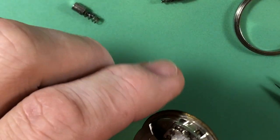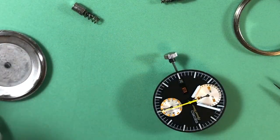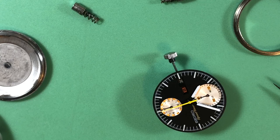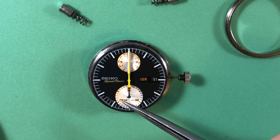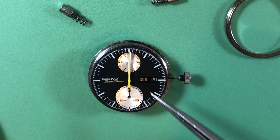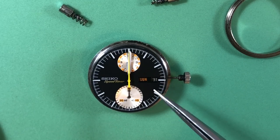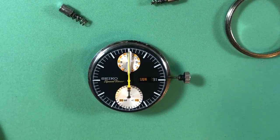When I see things like the wrong dial ring and lots of pitting in a case that got refinished heavily, that's an indicator to me that we are gonna have some fun. The dial actually looks pretty good - you've got some patina and a couple of little scratch marks, but honestly it doesn't look bad. The hands are original and your orange flashes are pretty unfaded, which is nice. Whoever built this thing, it clicks over to the new day perfectly at midnight.